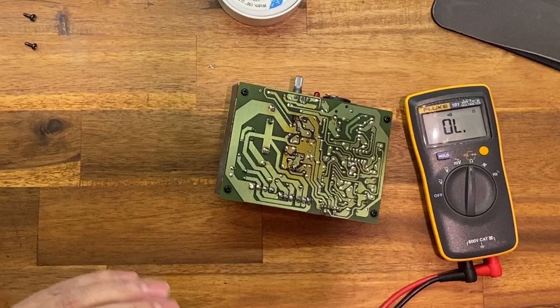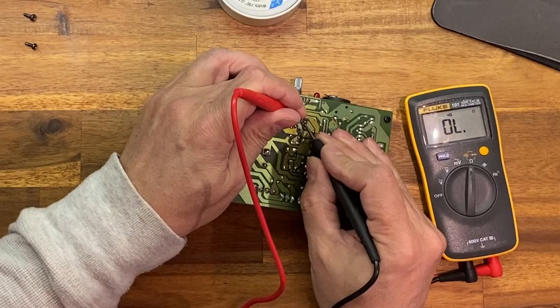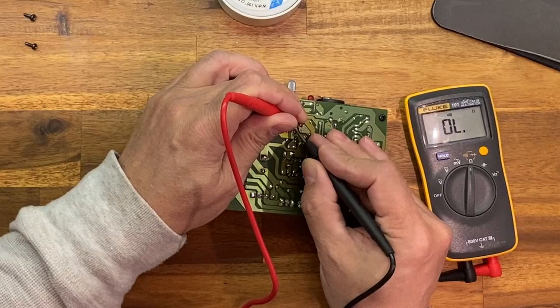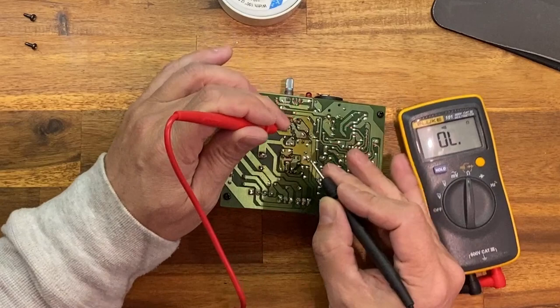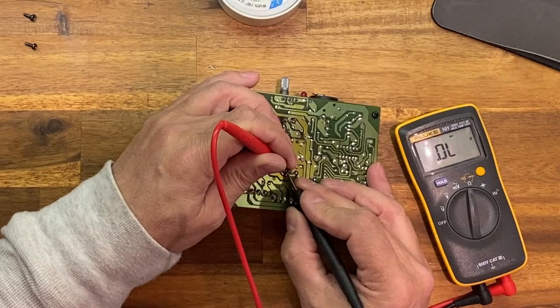So if we go across here, nothing. We go across there, nothing. Here, nothing. We go to reverse polarity, and I'm touching there. So that is still in good shape, no shorts. Again, checking this one before we put it back in, no shorts. And what you should have, if you're using an actual diode check, is about a 0.76 volt drop there,